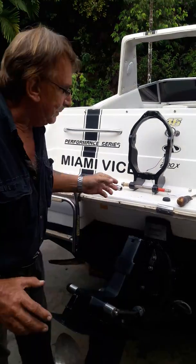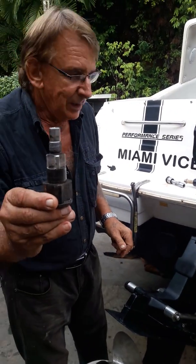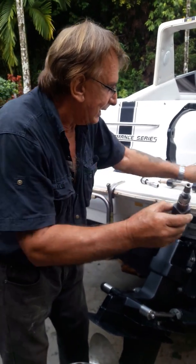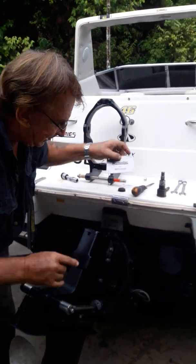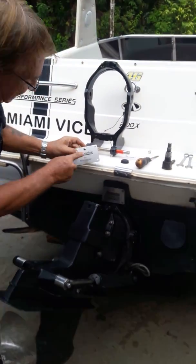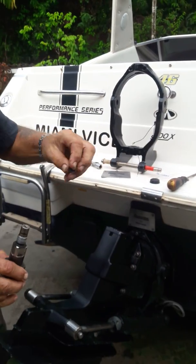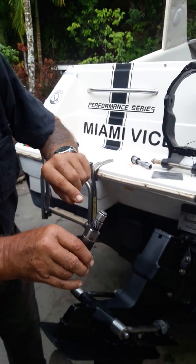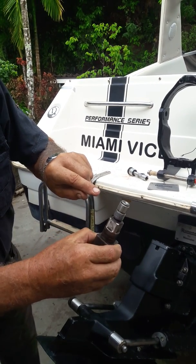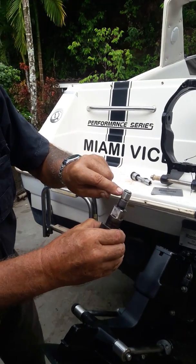That's it — all done. They put it back together with the new stainless steel gimbal pin from Romatec Switzerland. With the grease on top, the grease comes through and it will grease this one — you put a small hole through this one. Oil, a bit of 140 gear oil into here, will run down over this onto this one, once a year.